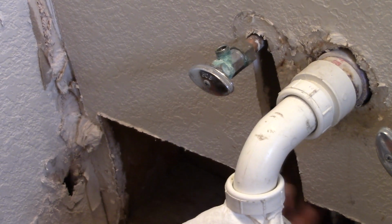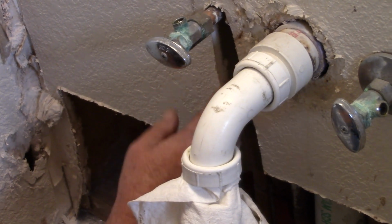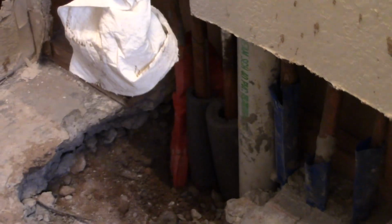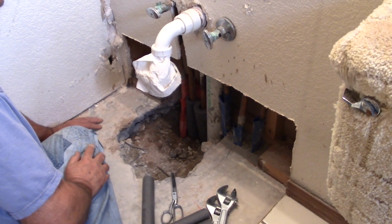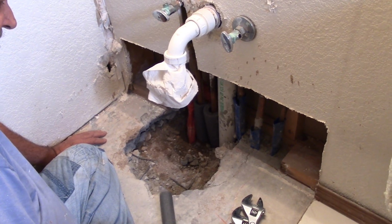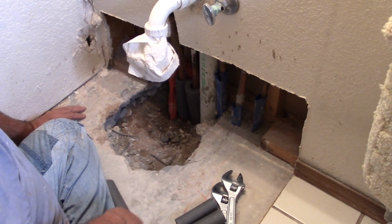Yeah, and this cut up like this is the smallest piece. I don't want to fool with trying to fill it in with plaster. I'm just going to cut it across the top. But I want it to be as square as possible, because it comes down and across and up and over. And I'm going to be cutting it with an X-Acto knife. Not a jigsaw? No, it creates too much dust. You just use an X-Acto knife and lay it out on a truck bed or the ground, and you follow your line as you're cutting the drywall. Do you need a template?